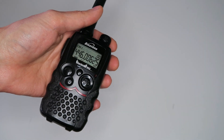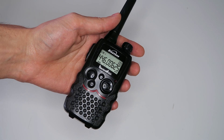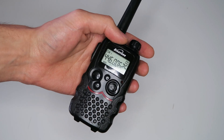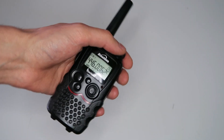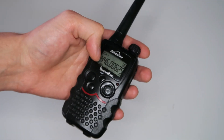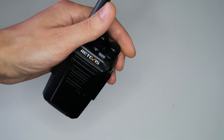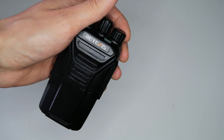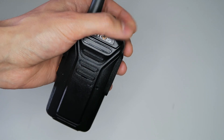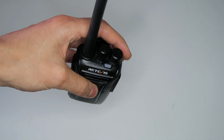I also like that the radios don't have what we call a squelch crash. Let me demonstrate this. If I am receiving on this radio and I transmit on one of the Retevis ones, you can hear the audio there, and you hear the noise at the end of the transmission — that is a squelch crash. It's not very pleasant, because if someone's pretty quiet on the radio, you might have to turn your volume way up, and then the squelch crash at the end of the transmission is going to be really loud. If I do the same thing on the other Retevis radio — one, two, three, test — at the end of the transmission, it doesn't do the squelch crash. See, at the end of the transmission there was no squelch crash; it just exited silently.